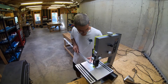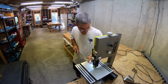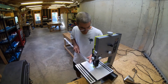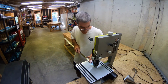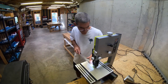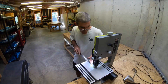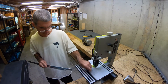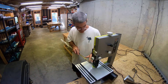Starting the first real cut on the airplane. Those first few cuts I made kind of perpendicular were just relief cuts into the material that would be discarded — I did that so that as I was making this 16-inch cut, I wouldn't find myself way down in a long, narrow cut with a bunch of excess hanging off the side. As I go along, the piece falls away — there it is right there.